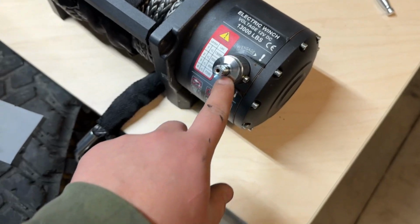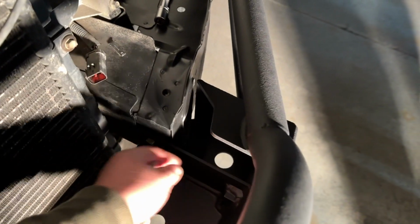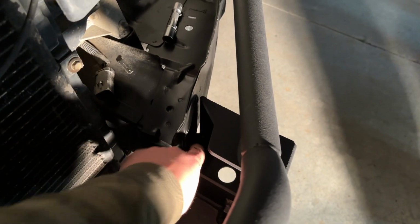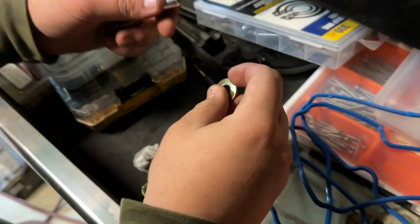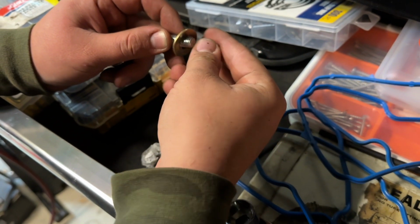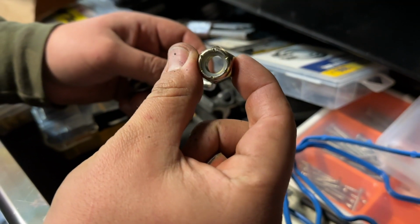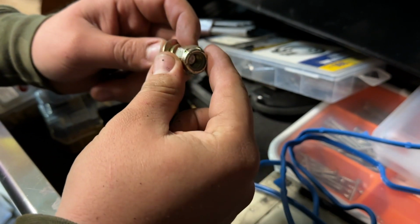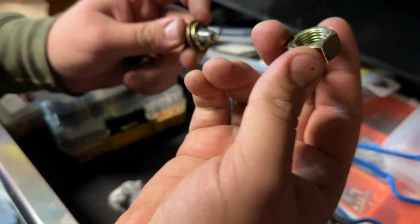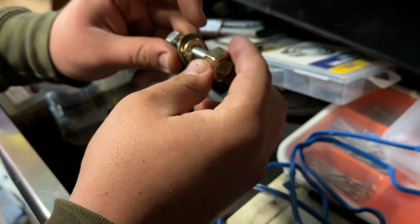Back together, got the lever on the side here, and we are gonna put in the 2 bolts. For these side bolts, what I did, because if you use the nylon nuts that are provided by DT, it's really hard to tighten them up since there is no room there. So what I did is the hole, I just put the bolt in like that much, right? And then I slipped the washer on it, pushed it out a little bit more. I put a lock washer on it. The kit provides you one of these nuts with the nylon, which it gets stuck right away, and you need to put a wrench in there to tighten it up. So what I did is I took one of these, just regular ones, slid it in there, and since it has the lock washer, it's gonna hold it in place.